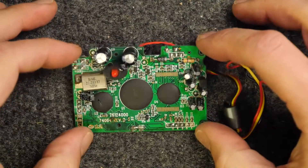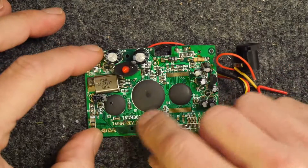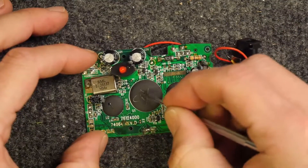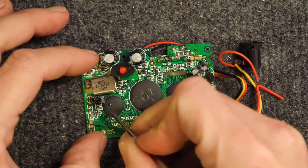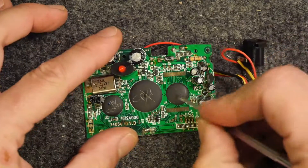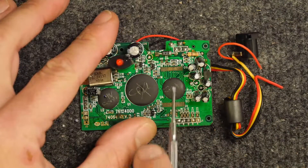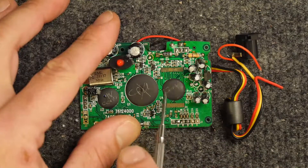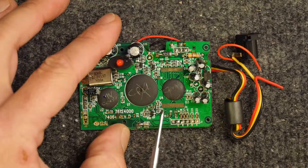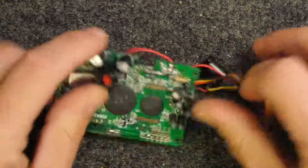For those interested, here's the actual PCB. I found it — it still has the power jack and the LED on it. It's a 21 megahertz system with lots of blobs. This big blob is almost definitely the CPU blob. This other blob — who knows? I think it's going to be the controller or the TV-controlling stuff. And this blob is going to be the games, because quite obviously you can see footprints for a RAM chip, a flash chip, or a ROM chip — standard memory chip footprints, like what you'd see inside a pen drive. They've just saved cost by blobbing it down. All these other connections are for the joysticks and the buttons. Video out is there too. Bye.